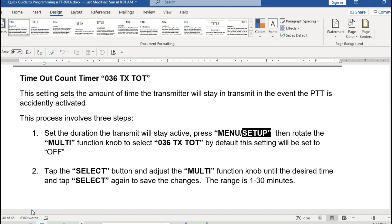With this feature disabled, you could actually be transmitting for a long period of time. If the PTT got stuck, or if you had the VOX feature on — where it's voice activated — and there was a lot of noise in the background, you could be transmitting for a long period of time, which could eventually do some damage to your radio.